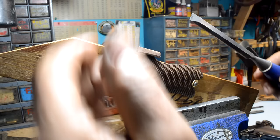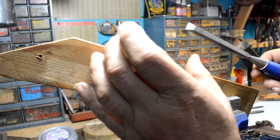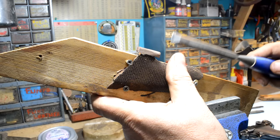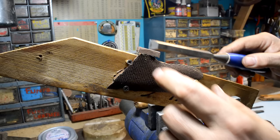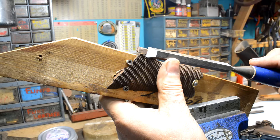I'm looking at this thing in plan and profile - the profile look is this way, the plan look is on this axis. All I'm doing is removing everything that doesn't conform to the outline. We can get rid of a lot of this material because if we're trying to cut through all of it, we're eventually going to make a mistake and snap this off - because this piece of wood, being so thick and oversized, has a tremendous amount of leverage. Extremely ridiculously sharp chisels really help here.